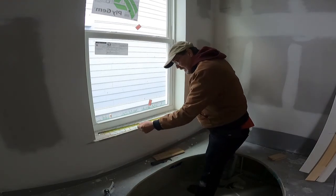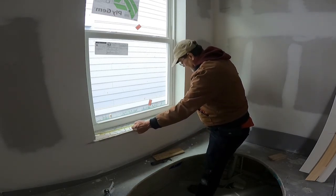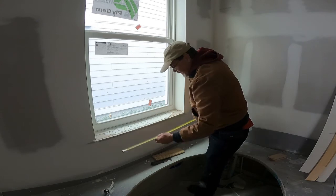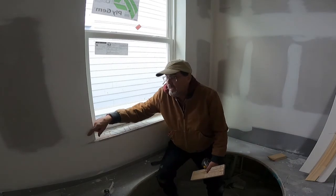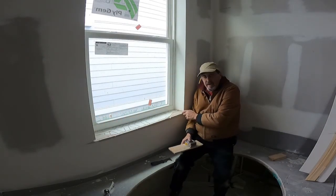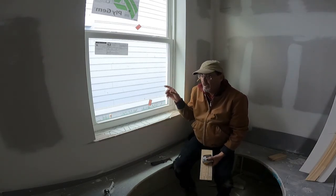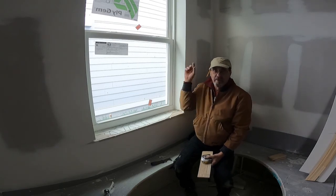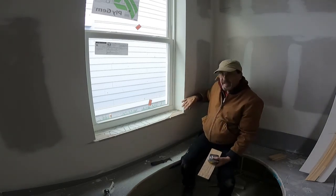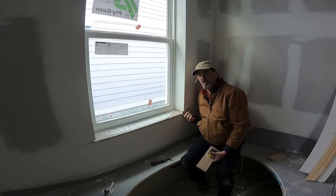But anyways, what I usually do when I measure up my windows is I take the overall measurement from corner bead to corner bead. And in this case, it's 34 3/4 of an inch. Now, with these particular windowsills, we have a 2-inch overhang on each end. We do that in case they go with shutter blinds. When they make the shutter blinds, they make them with a casing already on them and framed out. So when they put those in, the casing fits right on the ears of the windowsills. We find the 2 inches usually works out better.